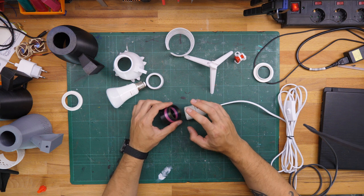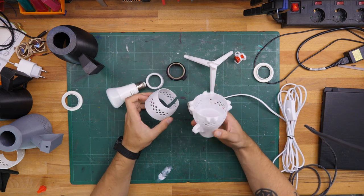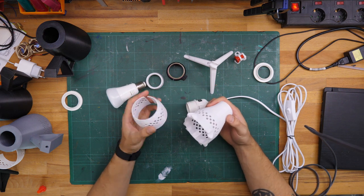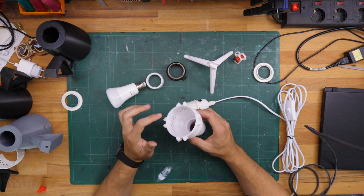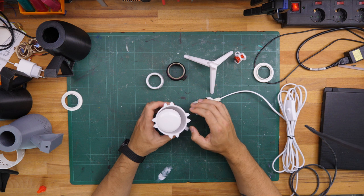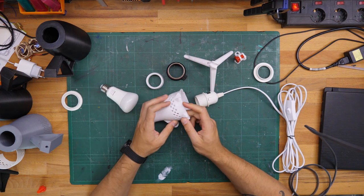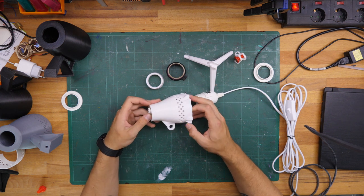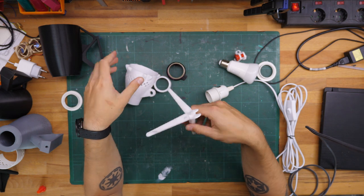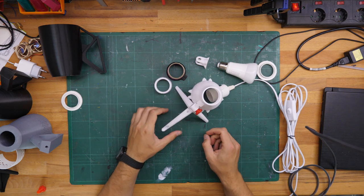I'm going to use hot glue instead of a perfect thread because it's a lot easier and I love hot glue. It's not the perfect thread fit, but it will help the hot glue hold on — this thing won't go anywhere once glued. I also wanted to print in black but also have a brighter light source: the black version will be black on the outside, and there's a white insert that slides into a little slot. Once inside, the white surface acts as a reflector and helps the bulb glow even brighter. I kept the holes and increased their diameter a little for a more industrial look.